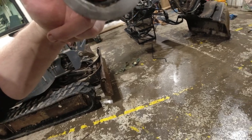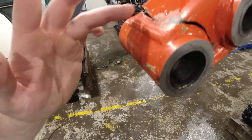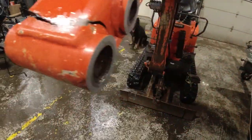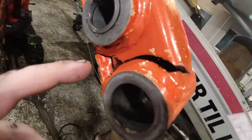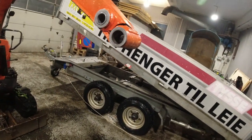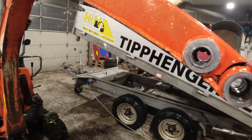The dust seal is there but it has escaped inward. What's happened is this seal has gone in, and it was too roomy - you can see the good ones are not possible to move, that's how it's supposed to be. It has torn up everything from down under all the way up here, and it's not long before it would be off. The crack has started underneath too. This was really close to a total failure - we caught it just in time.